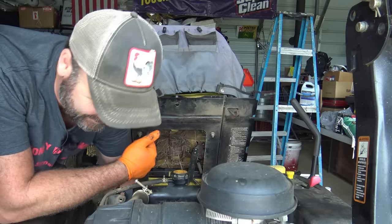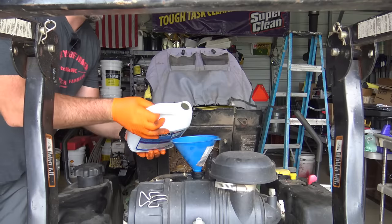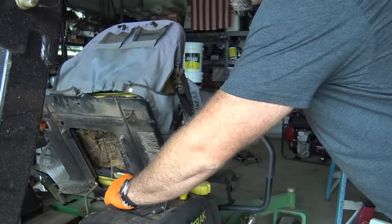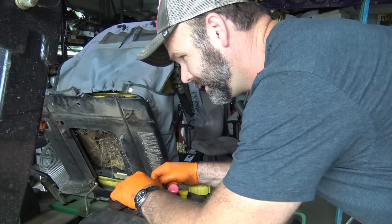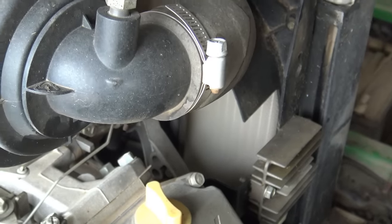Guys, right now I ask you — click that like button, and if you're new to the channel, go ahead and subscribe. We've got pre-diluted antifreeze going in. PTO off, brake locked — let's fire it up. This thing sounds like a Harley. I left the fan shroud off on purpose so I can see whether it's blowing fluid. We're going to get this thing up to running temperature and get a little rough with it to make sure we're not going to blow another hole through this thing.